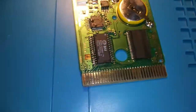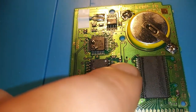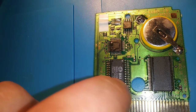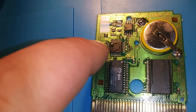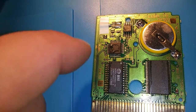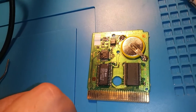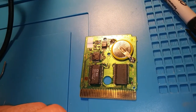Upon closer inspection, since none of that worked, I did find that there is definitely a broken trace — from there to there is supposed to be connected and it's not. So I'm going to do just a little bodge wire from that trace. This trace to here is good. Thank you, multimeter — appreciate your input. So if I do just a bodge wire from there to there, that should remake the connection. This thing may be too far gone — having that connection broken and getting powered up repeatedly may have permanently damaged it. But that's definitely a broken trace and I'm definitely going to try it.